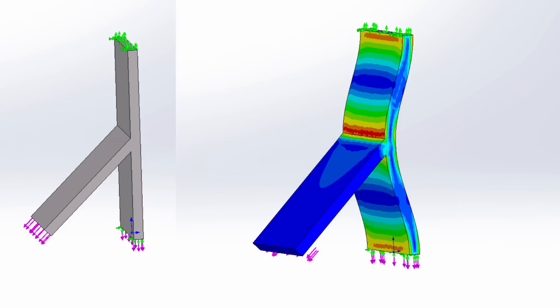The last thing I don't like about this joint is difficult to explain with tubing, so let's switch it to plates. If I have a vertical plate taking an axial load and another plate coming in at a 45-degree angle, those forces don't balance and we end up putting bending stresses into the vertical plate. That is not a good thing — we need something to balance that force on the other side, which this joint just does not provide. So we're going to end up with high stresses no matter what.